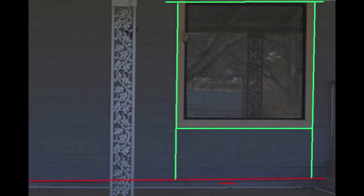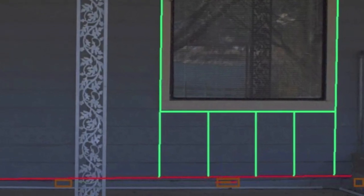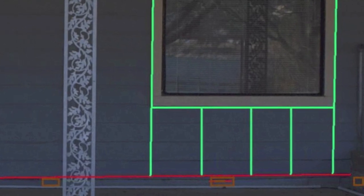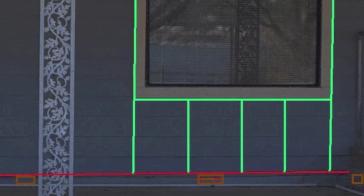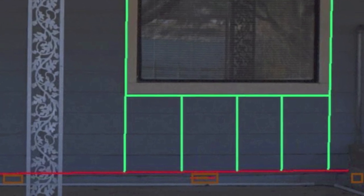You can see by the siding that I have an area that has sagged significantly. Leveling this floor is difficult for a number of reasons. The first reason is this large picture window. I must make sure that the primary lift occurs at the edge of the window where the primary loads are carried by the studs to the header above the window. At the same time, under the window, I must lift the exact same amount as the two primary lift points so I don't break the window. To make matters worse, one of the piers is located under the middle of the window.